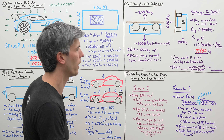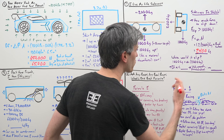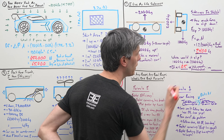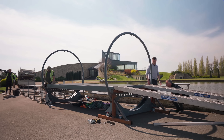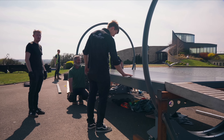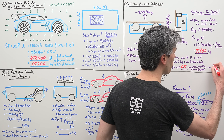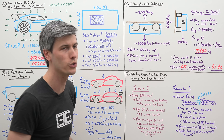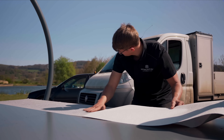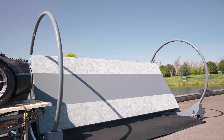But we're not on a perfect road surface. What frictional coefficient would cause this thing to start to slip? We can set 1,000 kilograms equal to the frictional coefficient times 2,000 kilograms, meaning if we have any frictional coefficient less than 0.5, the car will start to slide down that wall. For example, on a smooth painted steel surface that gets wet, the frictional coefficient could drop to anywhere from about 0.1 to 0.2 — that is a concern. So if the platform was just a little bit wet, the car could slide off. As a safety measure, they put grip tape where the tires are so they don't have to worry about the frictional coefficient dropping too low from any moisture present.